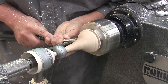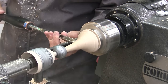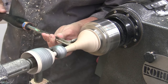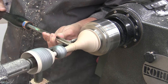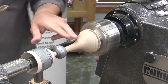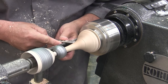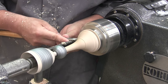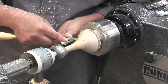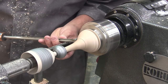I'm going to probably put a little skew cut in there just to get that line. Often the maple family will carry silica in it, which is essentially glass or sand, and silica dulls the tool edge very quickly. It's going to be a compounded amount of it anywhere near a knot or bark inclusion. A lot of you would have turned yew back in the UK and those white lines you see in the cracks are silica - you'll know also that they dull the tool very quickly.